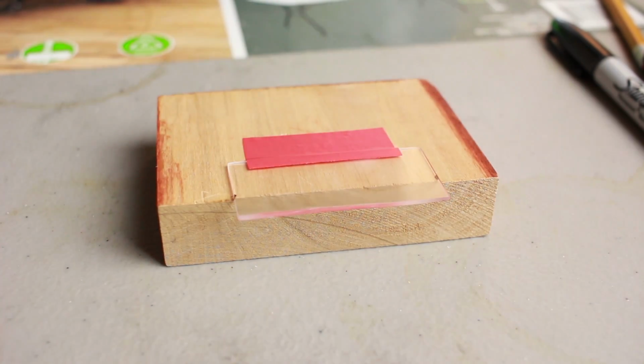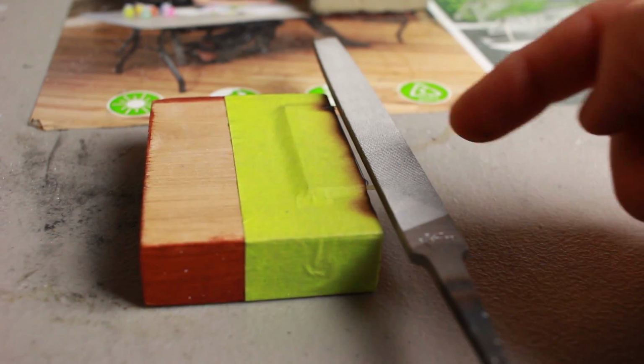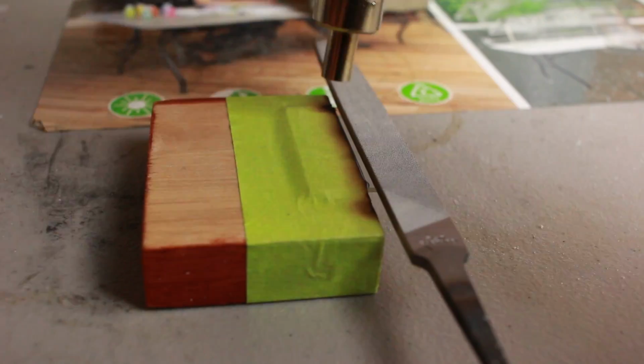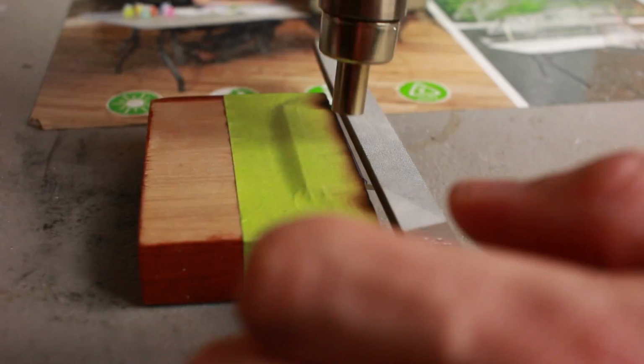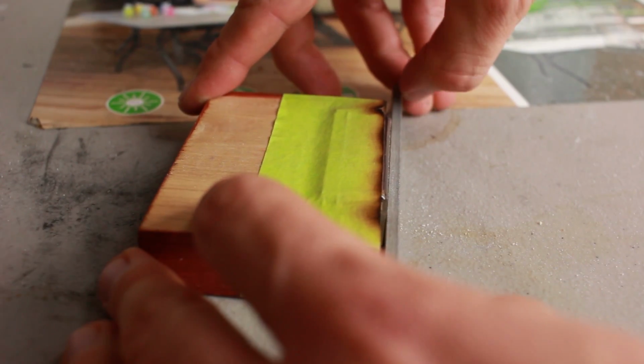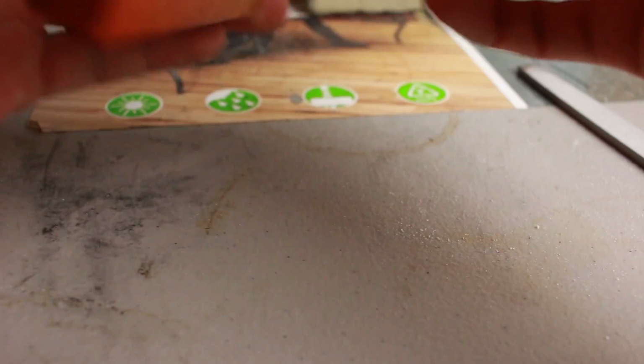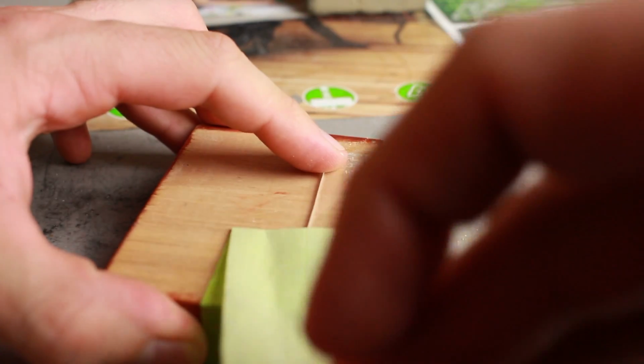Alright, new plan. In my second attempt, I switched the hot air rework station to 200 degrees Celsius with a blower speed of 5. I also switched to masking tape from vinyl electrical tape because the vinyl seems to melt pretty easily. The major benefit of the hot air rework station versus the heat gun is that I can more precisely focus the heat where I want it to be.